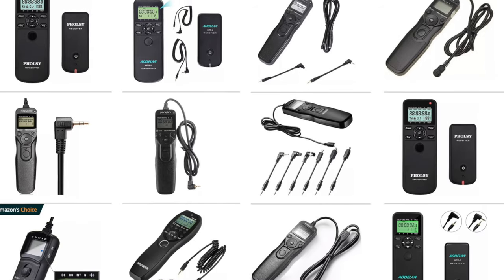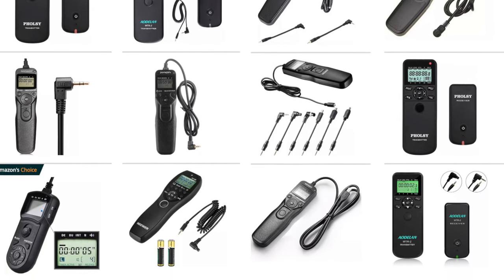Before I start talking about this remote, let's talk about other remotes. There are literally hundreds of remotes available on Amazon, eBay and any other website — any camera store sells a bunch. They range from about $10 to $150, and none of them are actually made for time-lapse. The biggest issue with these remotes is that they send two signals to your camera: the first is an autofocus signal and the second is the actual trigger signal. The issue is with that first autofocus signal.